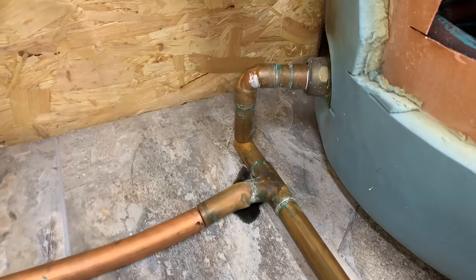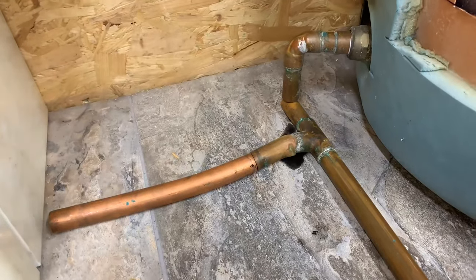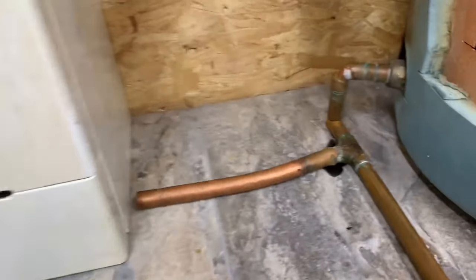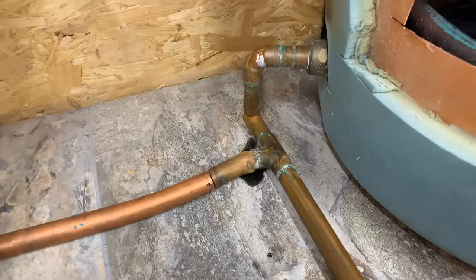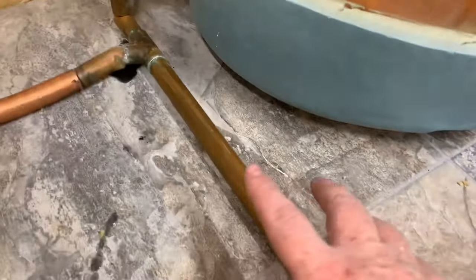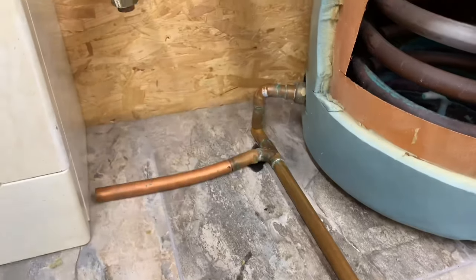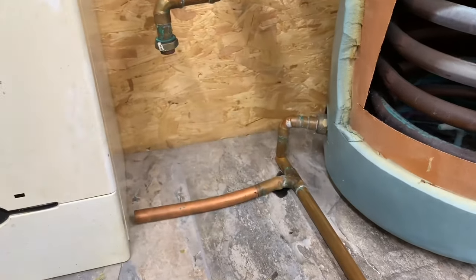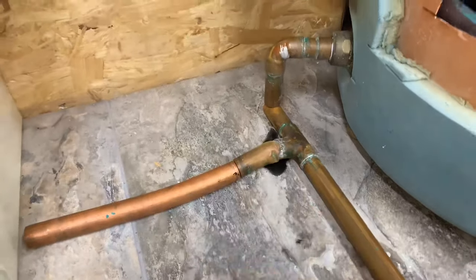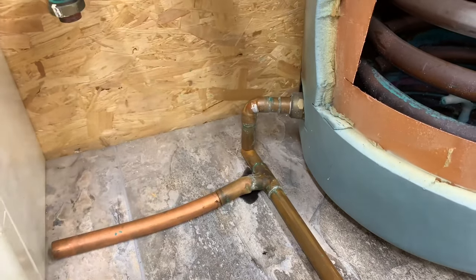This is the return, and we've got a T-piece there. The last T from the cylinder to the boiler should be the last T on the return. So if you're going to cut this out, you'd cut it so you can connect your new boiler in, and this pipe would then be the return from the central heating system. Depending on where your new boiler is going, you might have to get back to this T - but normally it's just there in the airing cupboard below the cylinder, so when you cut it all out you'll find it.